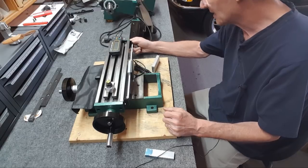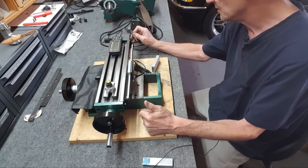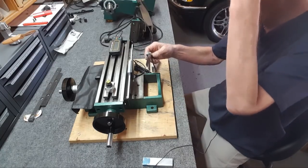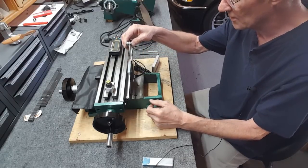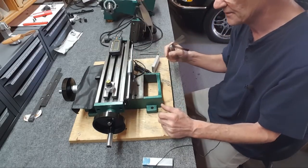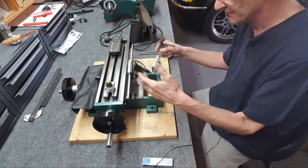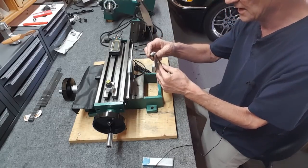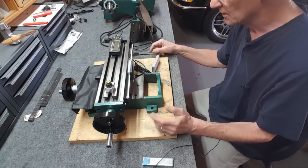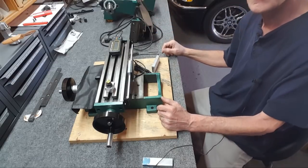On the old mill I did a block and made it work, and that axis is the most reliable — although it has occasionally gone nuts for unknown reasons. I'm thinking about using that metal banding they package crates with. I used that on the Y axis because you can easily bolt it to this and bend it and play with it until it's perfect — where when you run the screw in, nothing moves. If I could find something even thinner that would be great, so it doesn't put any force on this when you're traveling back and forth.